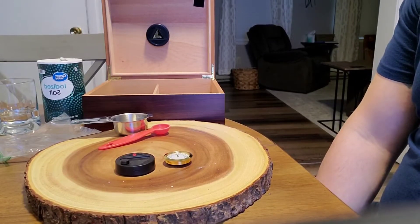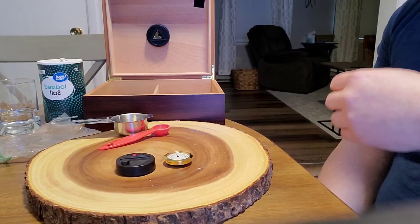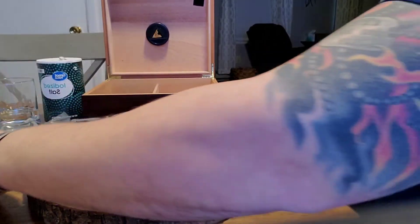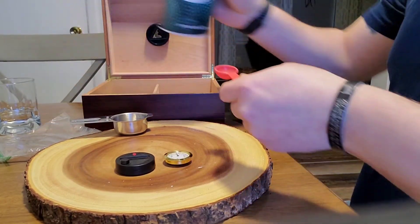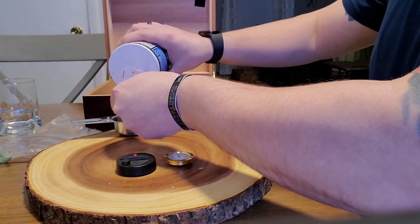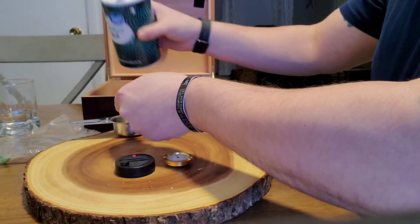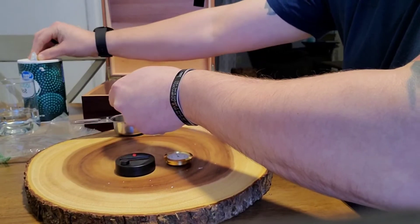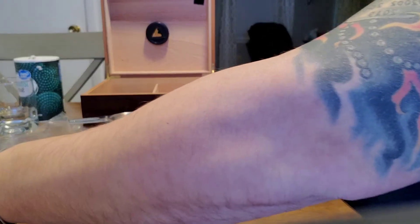What we're going to do is place a teaspoon of salt in the bottle cap and add a few drops of tap or distilled water to moisten it. Generally speaking, you'll want to use distilled water for seasoning or humidification purposes within your humidor, because of the minerals being removed from the water. But as for gauging the calibration of your hygrometer, tap water will do just fine — I wouldn't waste distilled water on simple calibration.